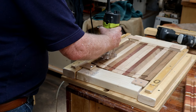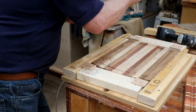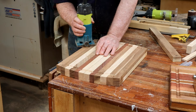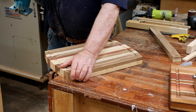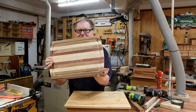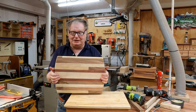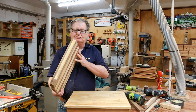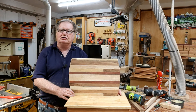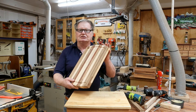All done with the curved groove. Now doing the straight groove with the other jig - put some stops in there too. All done. Now putting a half round over all the board just to break all the edges up. And around the curve it goes. We're almost there - came out great. I've rounded over all the edges, so all we've got to do now is sand and oil. Been a bit of a journey but the curved juice groove came out well. You see that it's not that hard - you've just got to do it in steps, and you can do just about anything you like. It's an old traditional way of doing it, swinging the router.